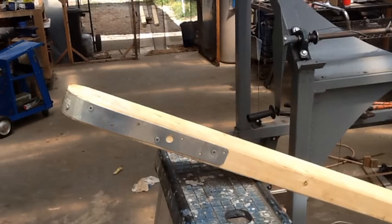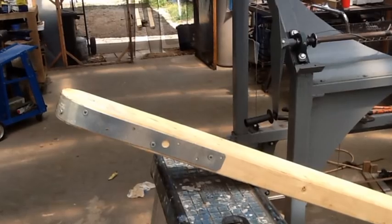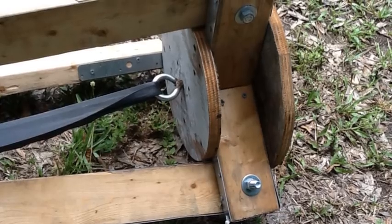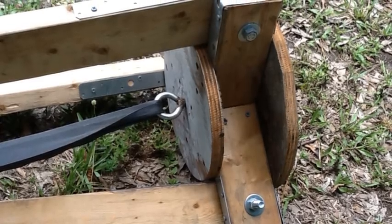After the strap is put in, I drilled half-inch bolt holes for the head and for the legs. The 8-inch by half-inch eye bolt that I used through the center of the head — I went ahead and welded that eye bolt closed so that it wouldn't stretch out under load.